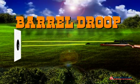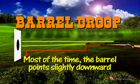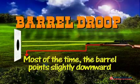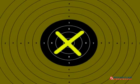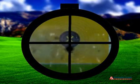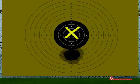While the barrel can point in any direction, most of the time it points slightly downward. When the scope is mounted on a rifle that has a downward angled barrel, the shot strikes below the aim point. It may be next to impossible to adjust the scope enough with its internal adjustments to get the aim point and the shot to coincide.